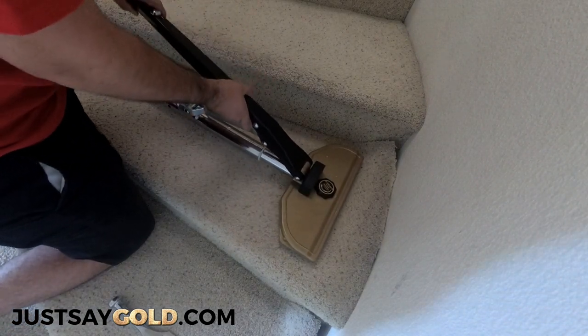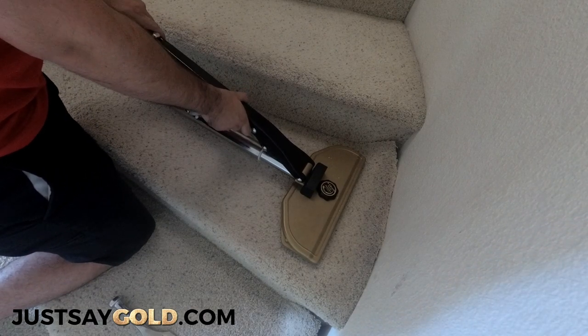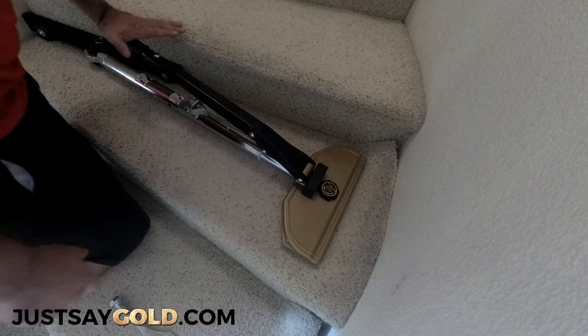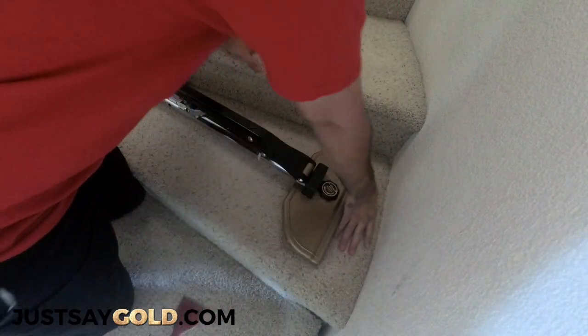Then, don't put too much pressure because the tail block can push through the drywall. You don't need that much force because this is only about four feet of carpet to be stretched. Most of the time there is a gap along the stair edge so you don't need to trim the carpet. Just pack it and hold the carpet down onto the tack strip before releasing. A set of stairs should only take about 10-15 minutes.